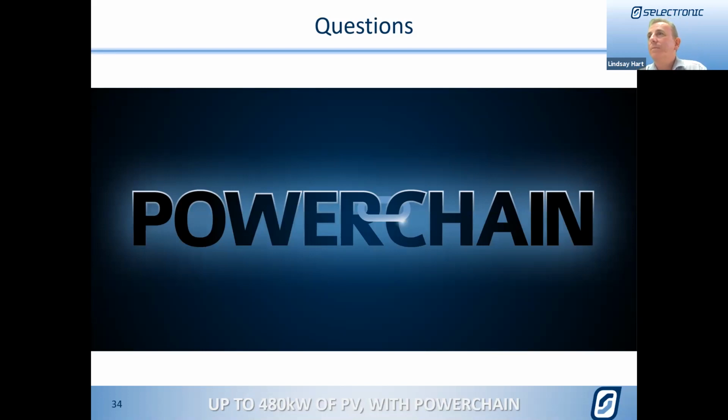Okay, so there's another question that's come in, not related to Powerchain, but it is something that does come up a little bit. Have you had any issues with 2i inverters, and whether it's 2i Series 2 or Series 1, it all applies, incorrectly reading lead acid state of charge? So the answer is fairly straightforward, no. However, it's all about the initial setup and whether and how the power and everything is managed.